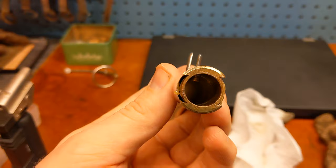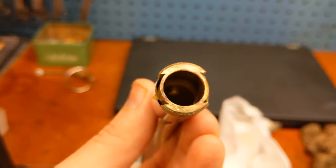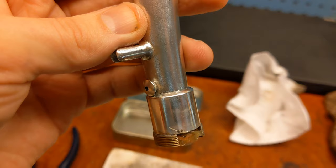Even if you did re-hone it, it probably wouldn't be an airtight fit anymore. So it has to be put back exactly as it was before, because you see that seam there — the inside slide actually goes past that seam, pretty much all the way up to the octave pip. You have to make sure it's put back the exact same way. As you can see, you'd have to look pretty close to realize that was re-soldered, and that's pretty much what we want. On silver plate, I'm feeling pretty good about that result. That's how you do that.